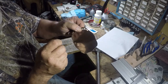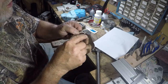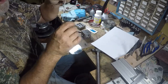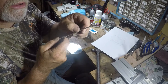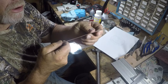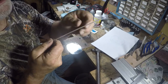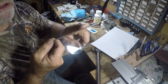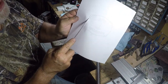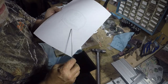I've got some flat rope — it's not really rope. What I did is I took some 10 gauge round sterling silver wire, annealed it, and rolled it through my mill, flattening one side and half-doming the other side. That is what will make up these outer borders — it will go in between the beads all the way around.